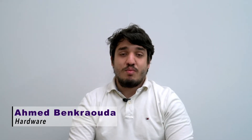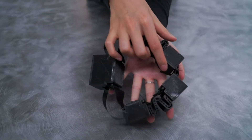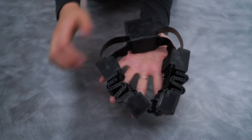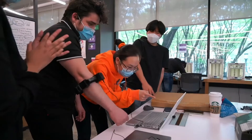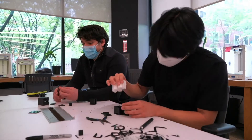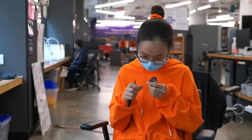After the sensors have been soldered to the PCB, the PCB is fitted into a wearable. The wearable consists of five units, four of which are sensor units. Each sensor unit has two accelerometers — one attached to the case itself and the other attached to foam which isolates accelerometer movement. This allows us to collect a clean MMG signal from the arm, connected through a rod attached to the bottom of the case. The fifth unit houses the microcontroller.